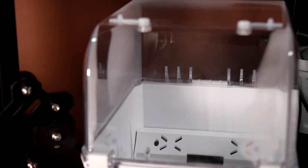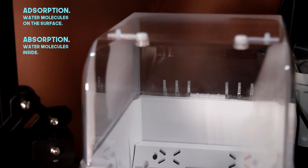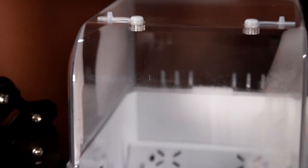What I was looking for was new moisture appearing at a certain point while heating up the chamber. As a simple demonstration, if you do this with silica gel it's pretty obvious — you get actual condensation. Silica gel is insanely good at adsorbing — with a D, let's not go into that — so much so that it literally lets out steam when you heat it up. Storing silica gel in a box with wet filament does actually dry the filament. I then did measurements of temperature versus humidity for a few reels of filament and found some surprising things.